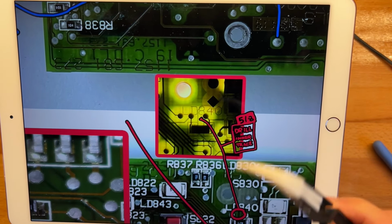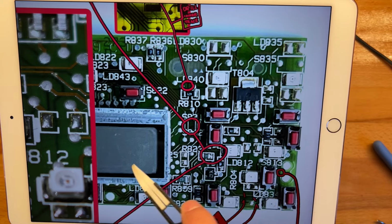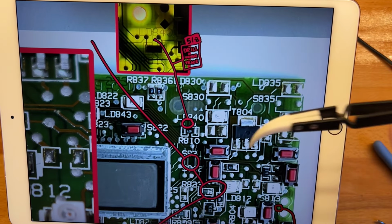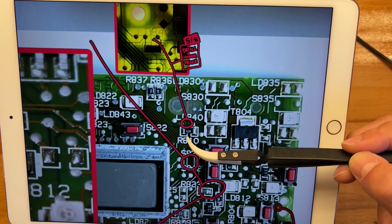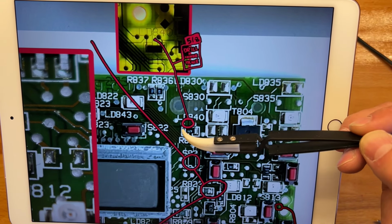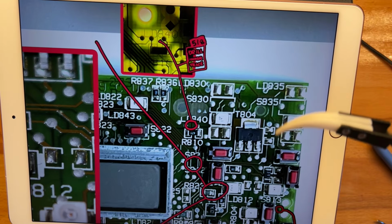So this is a pain in the fucking ass. As you look at the board with the display up, text right up, you have R810 and you will see a trace snaking right through these 2 pads or vias, whatever they are. Now you have to take a 1mm drill and go very carefully. I think in this point you can actually go all the way through, but yeah.